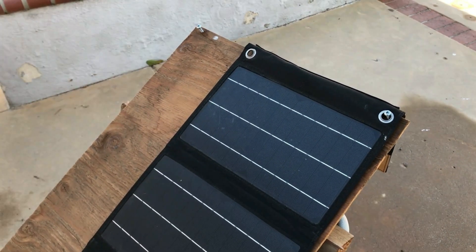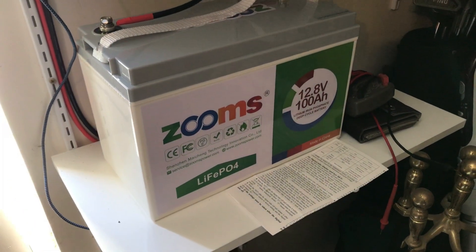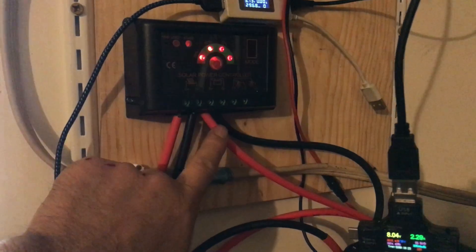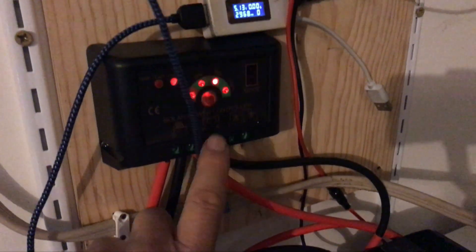Here's my battery — it's a Zoom's lithium iron phosphate 100 amp hour battery. This is my wire from my solar panels going up into the charge controller, and then the battery output. I have it all tied in on the back of my inverter. I've got battery cable coming from my battery, and the other side comes from the charge controller, so the charge output from there goes in. Everything's connected together on the back posts of this inverter. I've also ordered two jumper blocks — one positive, one negative — so I don't have to keep fiddling with the connections on the back of the inverter.